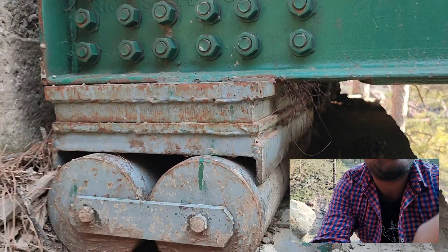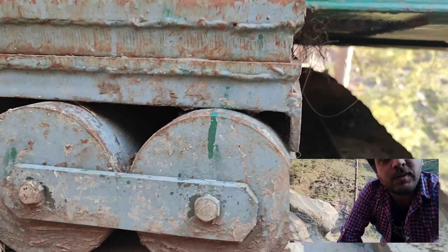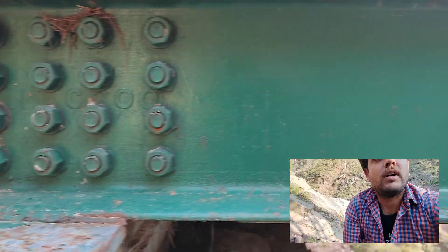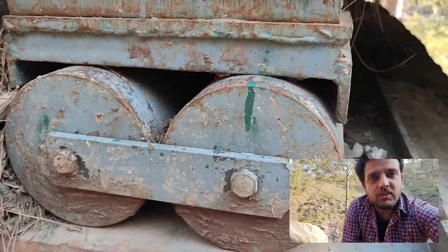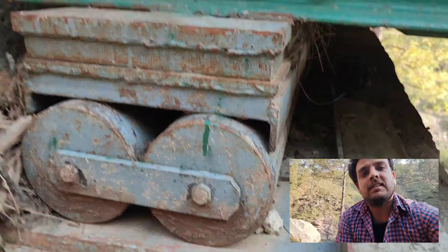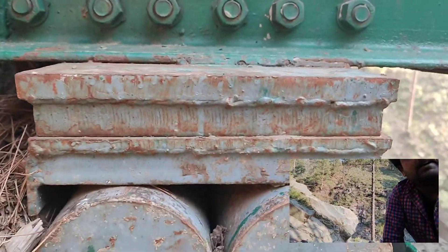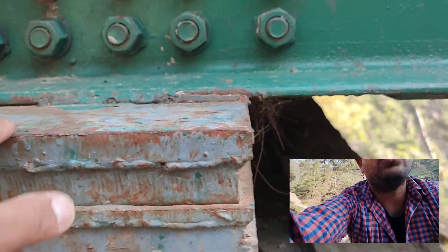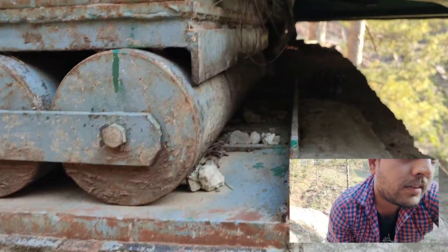Just have a look at how the connection is made, how the bearing is ensured, and how this bottom cord is connected to this roller bearing — because I'm 101% sure most designers in the design office would not have seen something like this so clearly. Just focus on the details: the top plate is connected to one mechanical arrangement, welded to the bottom cord of the truss.